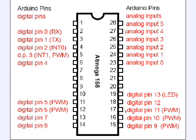All right, here's a little bigger outline of the ATmega 168. This shows you what pins are located where. If we go to our upper left-hand corner, of course, at electrical pin 2 will be digital pin 0. When you program it, you will only be dealing with 0, 1, 2, 4. You don't need to remember that digital pin 0 is at electrical pin 2. The software takes care of that for you.